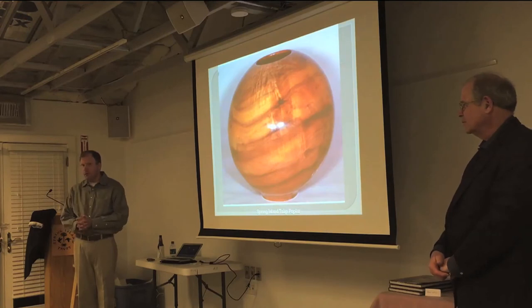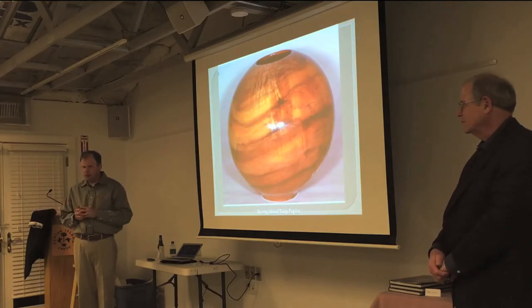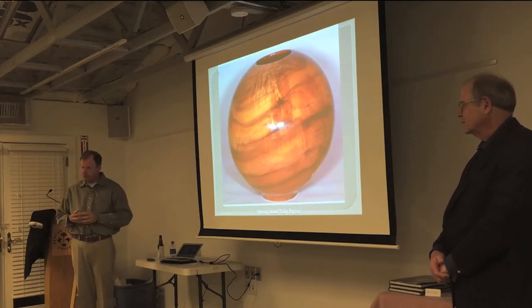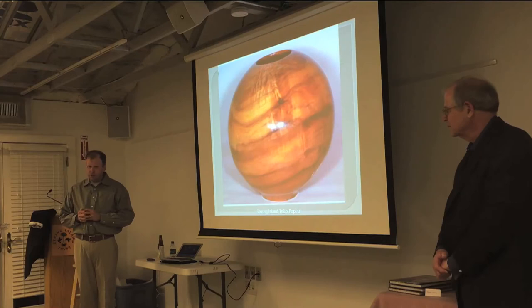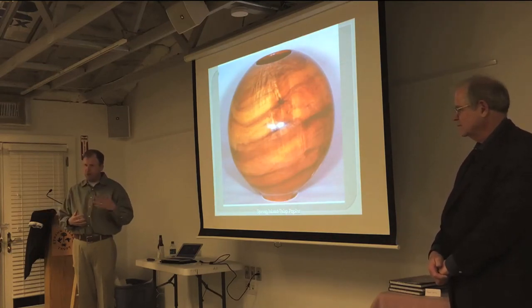And so it's highly versatile because wood moves. And sometimes other finishes that have a hard coat can crack. This one can actually bleed with the wood, so it has an elasticity to it, and we have to be conscious of that. We can control how hard the finish is, how soft it is, how quick it cures, how thick it is. So we inadvertently developed a lot of science about our chemistry on the finish and the science of the wood properties too.